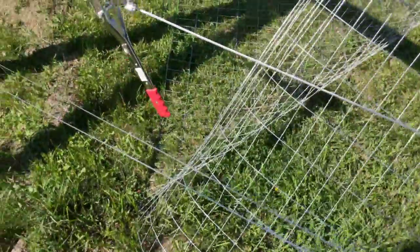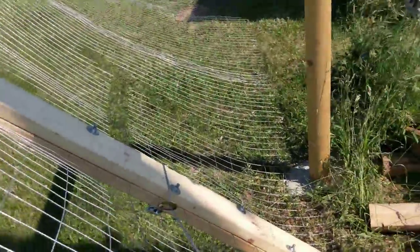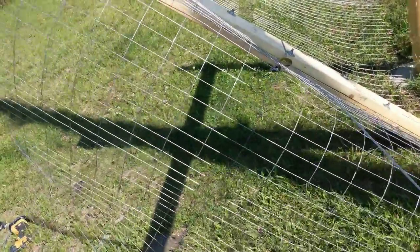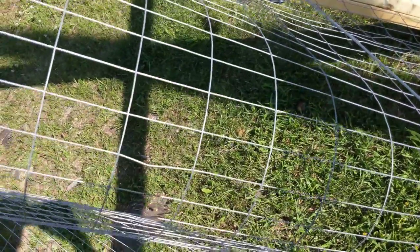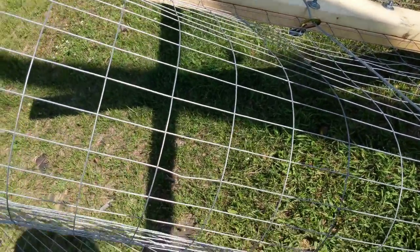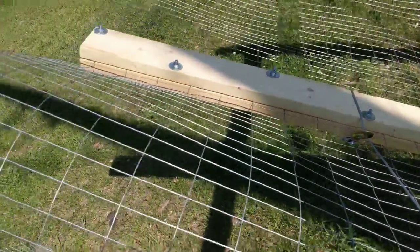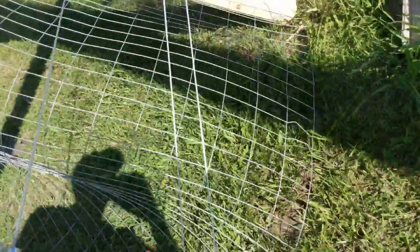Through the magic of editing I've saved a little time walking down. So how do you stretch welded wire fence? It's not easy. Ranchers use what's called a wire stretcher, but that doesn't exactly work for welded wire because as soon as you put any pressure on it, it bends. These welds are really light machine welds, and as soon as you put pressure on them they're going to break. So we can't do that — this is what I've come up with.